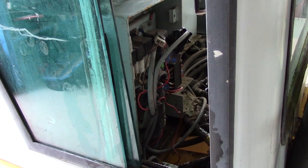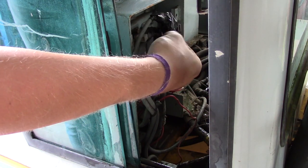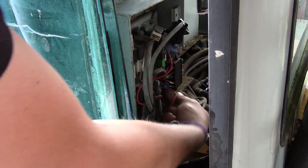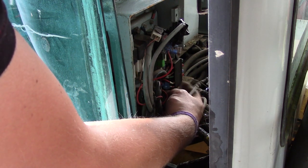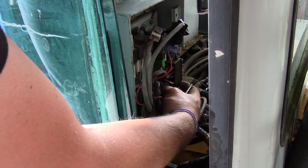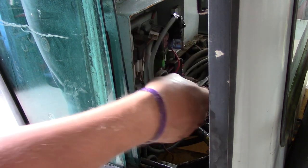After opening it up and removing everything, here we have the connection. It has its own fuse, but it is connected on another fuse down here. And that one, when I put something in, blows directly. So there is a short somewhere causing that fuse to blow. The question is if it is in this lead here or somewhere else.